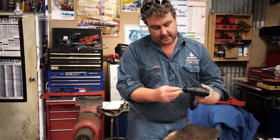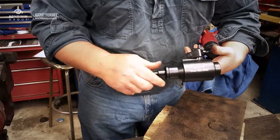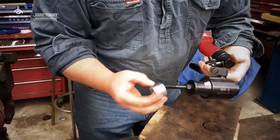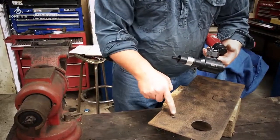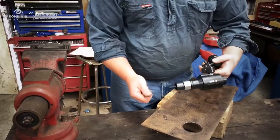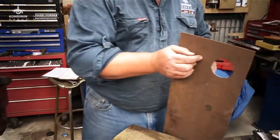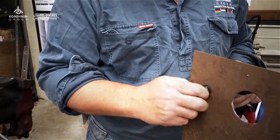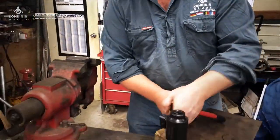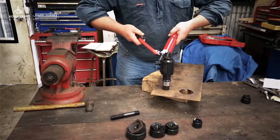We've already drilled an 11.5mm hole here with a standard drill bit — that's all you need to start with. Use a small arbor and attach it to the hole punch, just screw that up hand tight. This adapter sleeve goes on there and we choose the smallest die to start with. If we want a large hole we have the choice of drilling larger or using the punch to take out enough to put a larger arbor through. Screw the cutting edge up on the thread until it contacts, then put our safety glasses on. The jack can be positioned wherever is appropriate and we just start pumping.